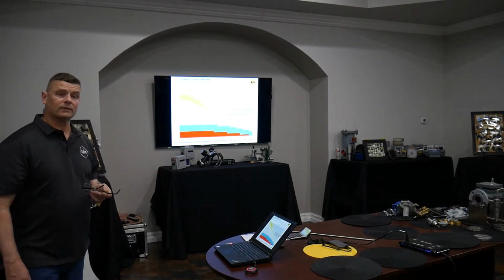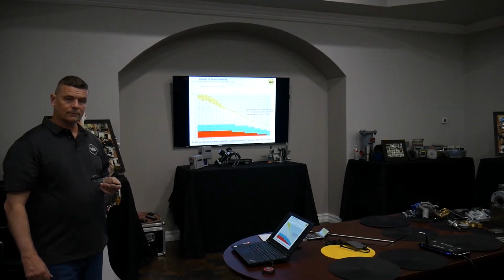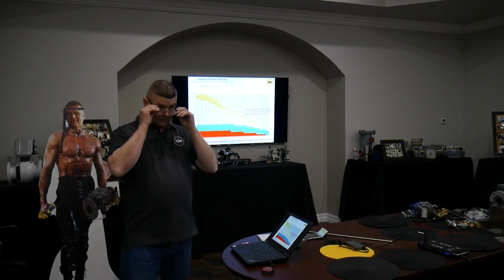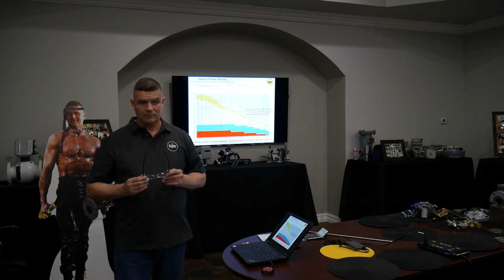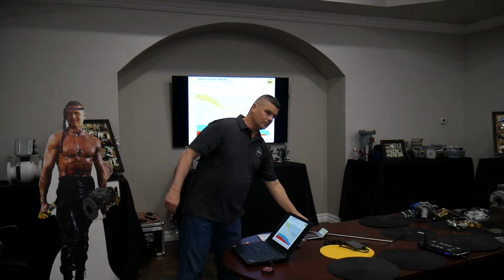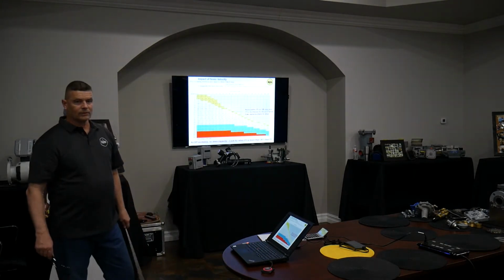So yes, as ultrasonics have been growing in our industry too, one thing with these regulators, I have similar customers who are changing out parts and regulators and putting things in. These vibrations in the lines start causing a lot of problems when they put these regulators in. They're undersized. You're talking about sizing, and they'll sit there and vibrate so much that the ultrasonics is reading, hey, there's a big problem in your line, something's going on. The acoustic signal that it's receiving is ridiculous. Something needs to be done in the line. So it goes beyond just the regulators as far as the impact of that.